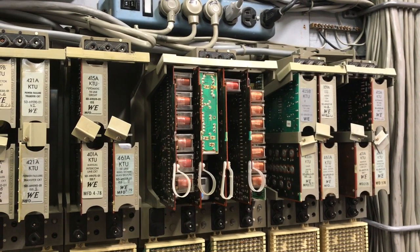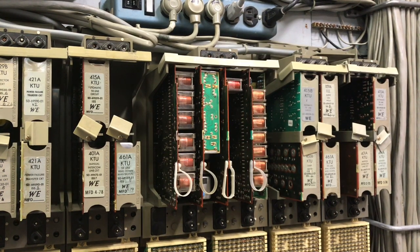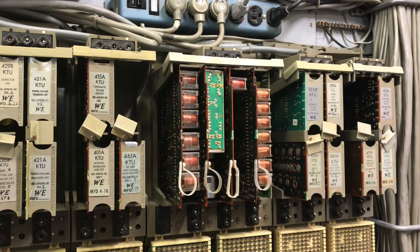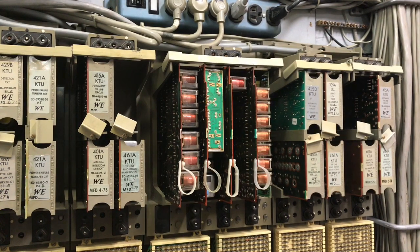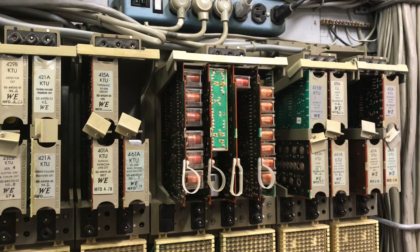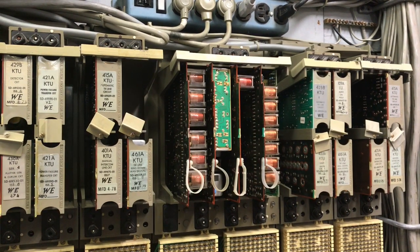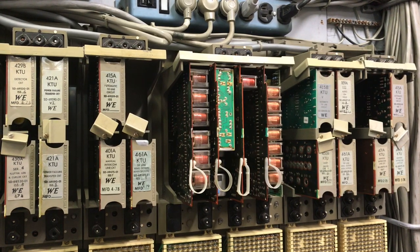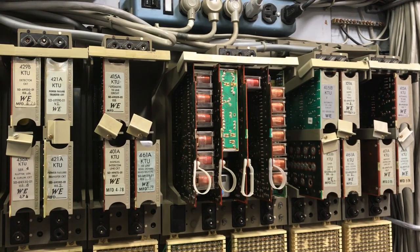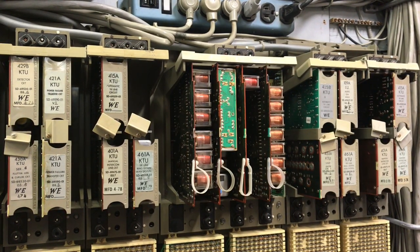For this video I will be discussing a deluxe dial intercom. This intercom uses the same rotary dial card and touch tone decoder that you would find in a 641 panel as well as other systems. This also has a three-link adapter card and a selector extender which allows it to have additional stations. Normally your 641 are 19-station, or if you have a really old card, a 10-station intercom card. This one has the ability to be up to 37 stations as it is configured.